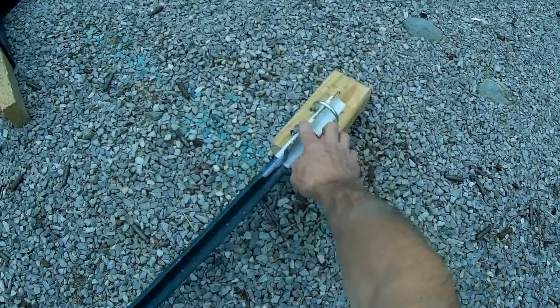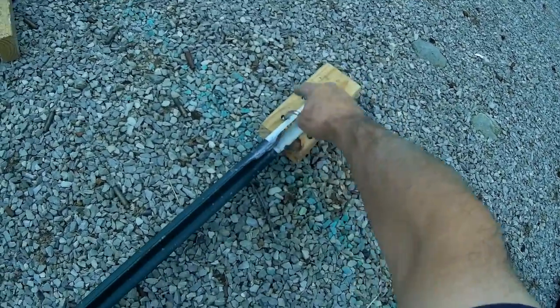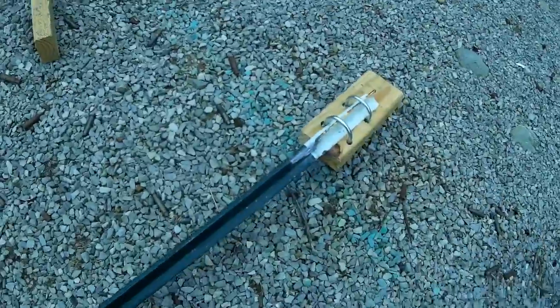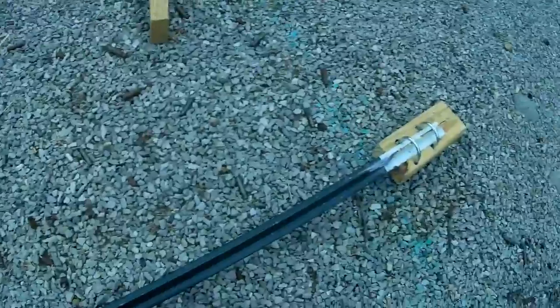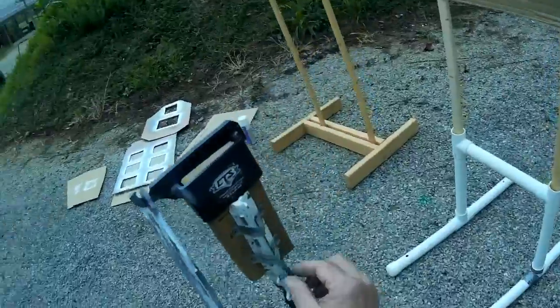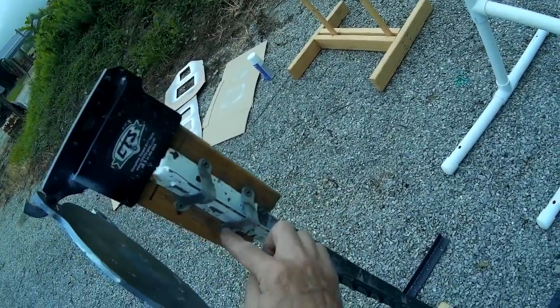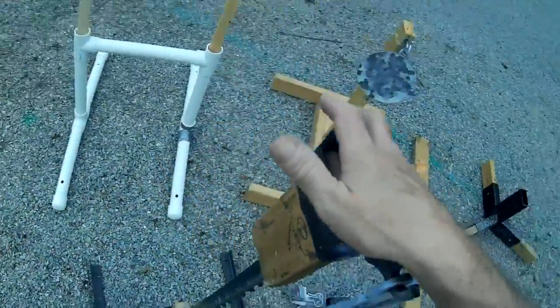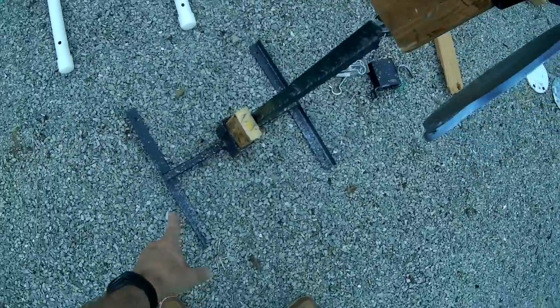I use these U-shape brackets — I don't know what they're called. I pre-drill into the wood and then I place them. They are about $1.40 each, so that's about $6 of attachment hardware. On my new system, a bag of 5 is about $1.50, and then I screw them in. If they are 2-inch screws they will come out the other side, but I ground them down.